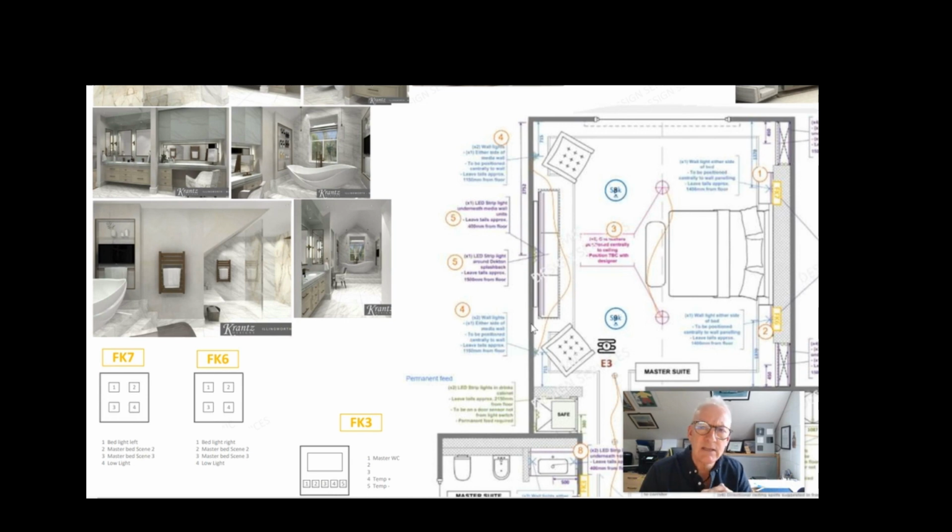So in this house, we're using a system called KNX. It's been around for a long time, over 30 years. But one of the unique selling points of the KNX platform is that it also integrates the heating. So it does away with those separate stats on the wall, because each keypad here has a built-in probe. And also, depending on the design, we also have the temperature display. So that is really great for you interior designers that want nice, clean walls.